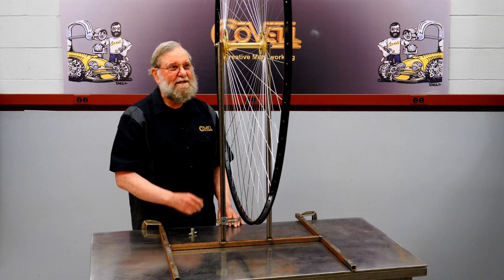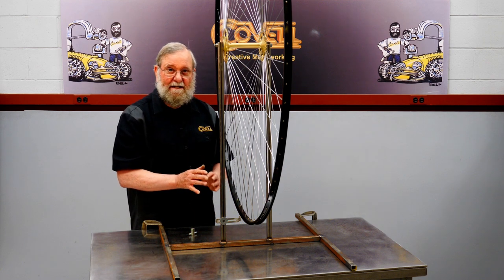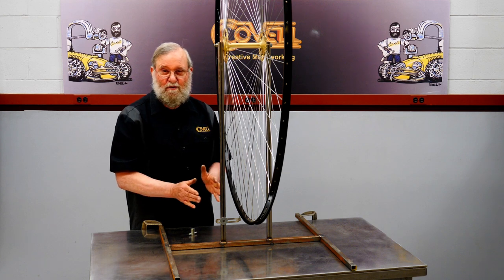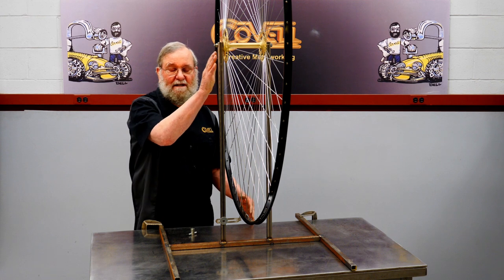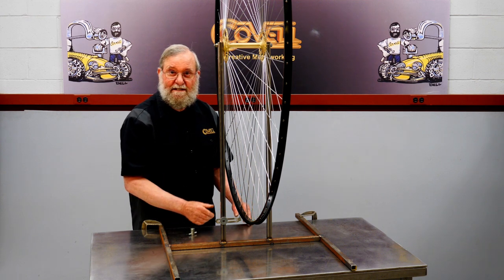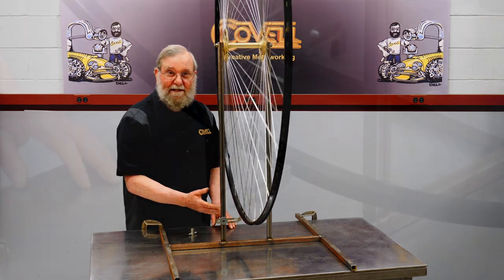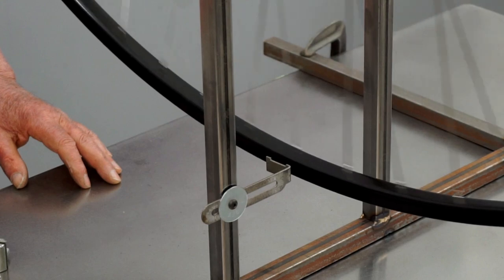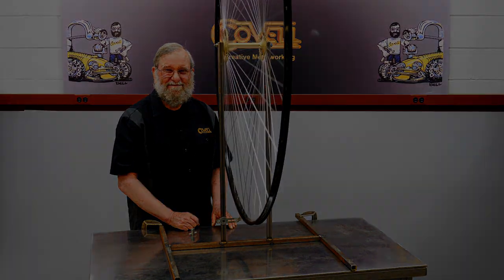The first step was simply to assemble the hub and the rim with the spokes. Now that that's done, I built a stand to help true the wheel. So by truing, I want to have the rim centered on the hub, and I want to eliminate any runout up and down and right to left. And I'm a beginner at this, so I've gotten it reasonably close, but I'm going to send it out to Jules at Watsonville Cyclery, and he'll dial it into perfection.